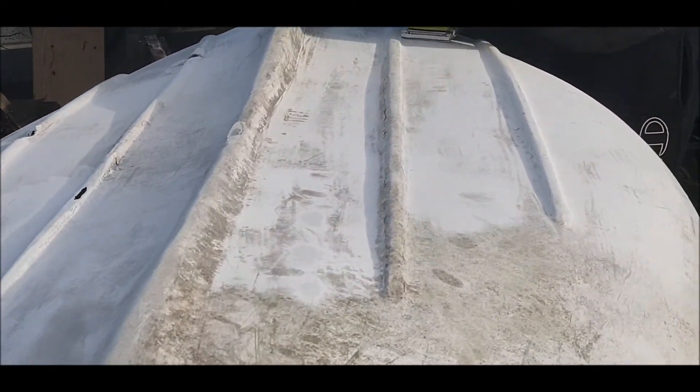It's quite a pleasant day - we're going to start with all this. That's the foam on the inside, another one there. That one there - it looks like it's been sitting on just this side, and it's actually had a lot of damage. We'll grind all that because that's cracked as well. We're sanding it all down and then we're going to fiberglass this part and strengthen it. We need a strengthener across there as well, and a strengthener on the inside pushing it.